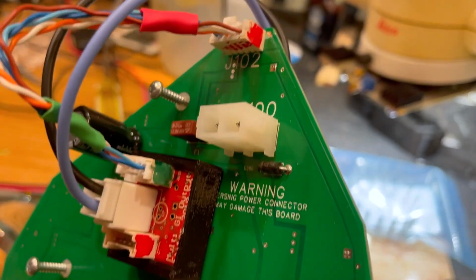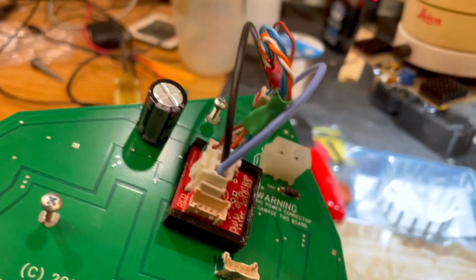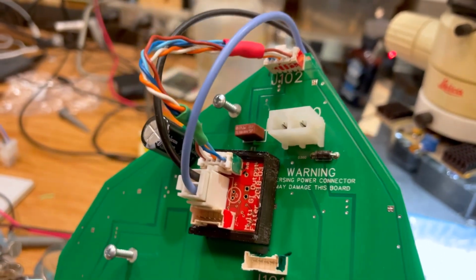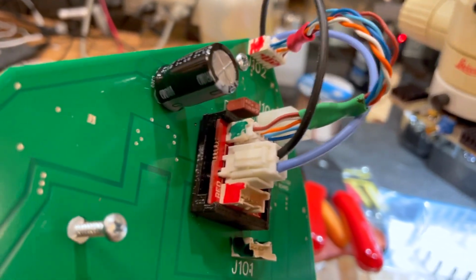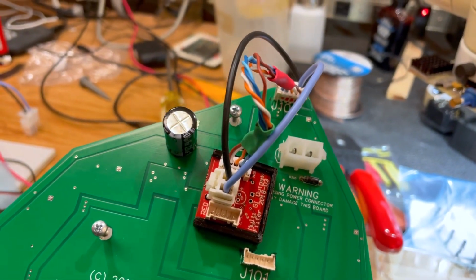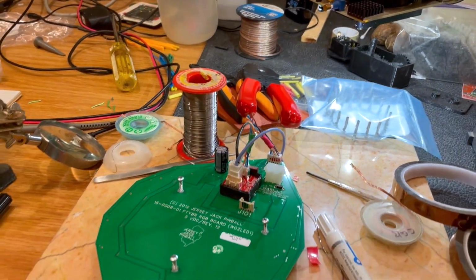So I've replaced that top connector, and I've got my 3D printed buffer board holder stuck on the fish board with 3M VHB, the very high bond strength. This stuff is great. And the power to that buffer board is just the standard Jersey Jack connector, but I've got it soldered onto the back of the main power connector on the fish board. That part's a little kludgy, but it's still modular. So yeah, looks like it all works, and I'll be back when it's mounted.